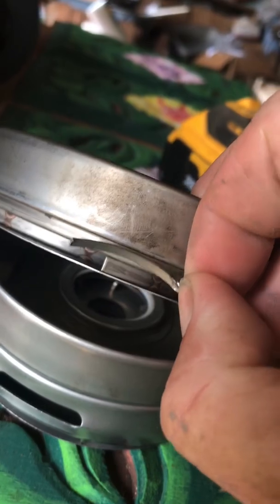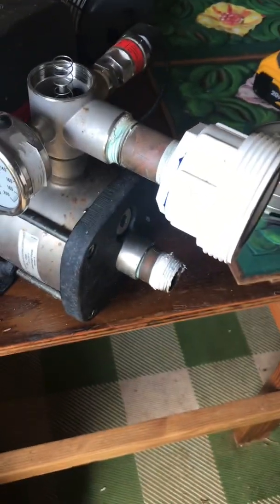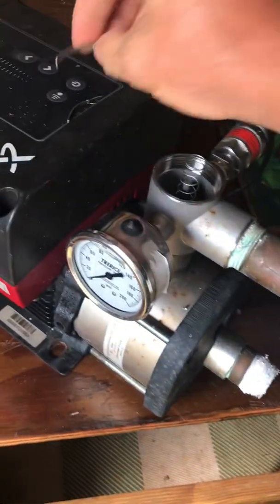Well, they're actually fins from one of the stacks. Here is a replacement stack, and you can see inside this little groove here are fins that are welded in. That's what moves the water. So these little things here are some of the blades that go inside right there. We're going to take this apart and see which stack has messed up and let Grundfos know.